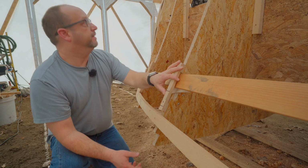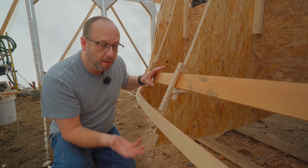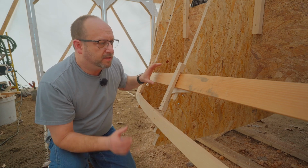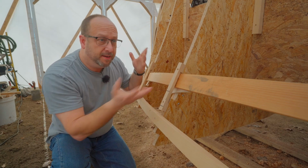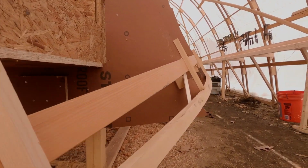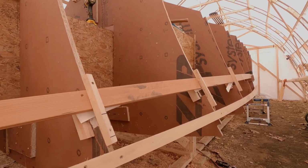And the way I found that here at station 3 was I just notched the different stations a little bit and started moving this up until I could feel the edge setting relax. And what I found as a side benefit of that is that the twist required at each station was a lot easier to put in, and now everything is pretty much roughly tacked in place. A few shims just to make sure the twist winds up being what it needs to be at each station. And most importantly, by putting my eye down it, I haven't created any bumps in anything anywhere.